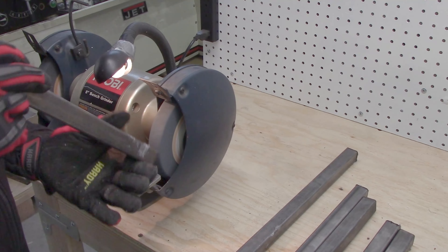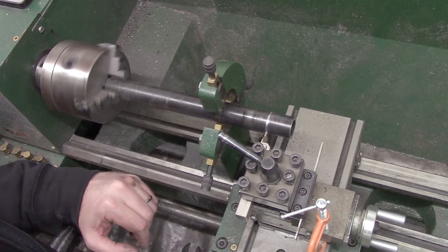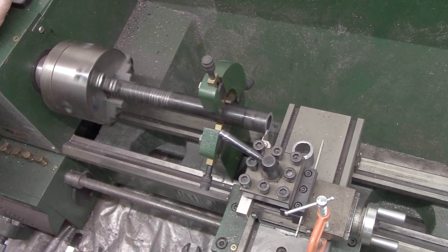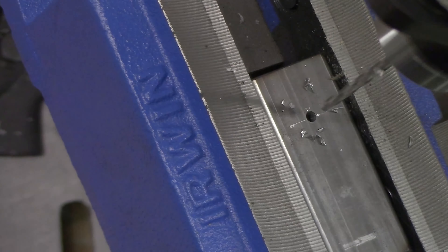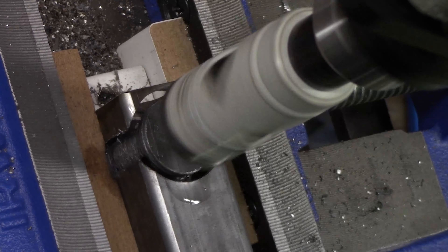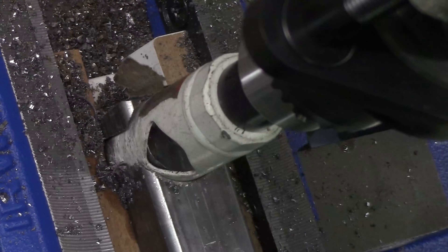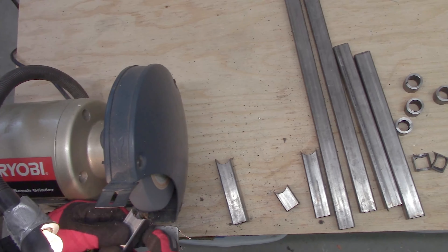I cleaned and beveled the end of each piece on the grinding wheel, and then I cut four pieces of tubing on the benchtop lathe with the lathe cutoff tool to weld to the ends of the vertical posts and hold the engine mounting bolts inside rubber grommets. I marked and drilled some pilot holes in the posts on the small drill press to prepare them for drilling with a one-inch hole saw. I then ran them through with the hole saw, leaving the rounded receptacle to house the pieces of round tube I cut off earlier. A regular hole saw from a local hardware store run through the lowest speed on your drill press with plenty of lubrication will do all right in mild steel tubing.